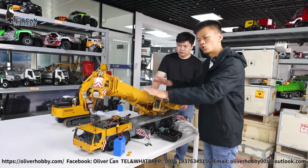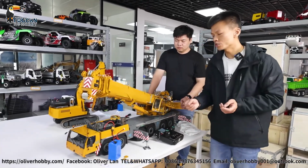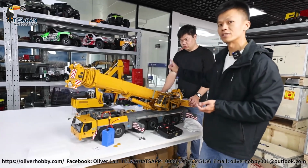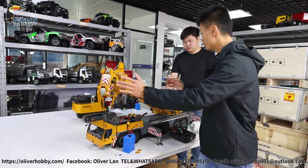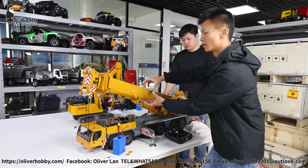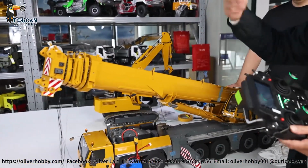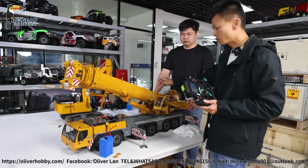Let's explain what we are going to do for calibration of the number 5 point of the forward boom. Maybe you already watched my other 4 videos about calibrating number 1, number 3, number 4. Of these, the most rear side number 1 point is the easiest, and number 6 point is also easy. But for the middle booms, number 2, 3, 4, 5 points, all the locking points are blocked by other booms, so we have to manually pull out all the booms. But for the first boom, if it's not coming out after you play and calibrate something wrong, the situation is more complicated than the number 1 to 4 points.